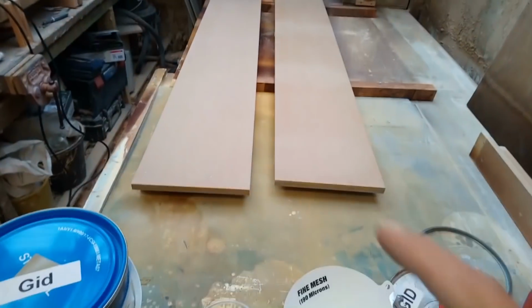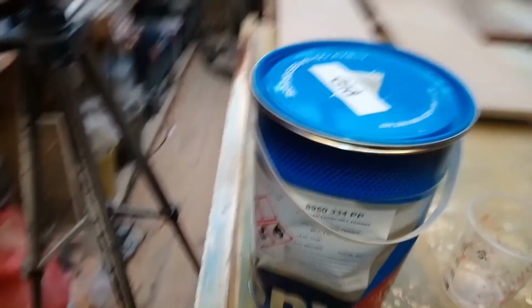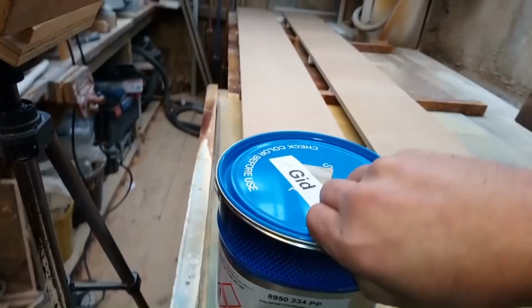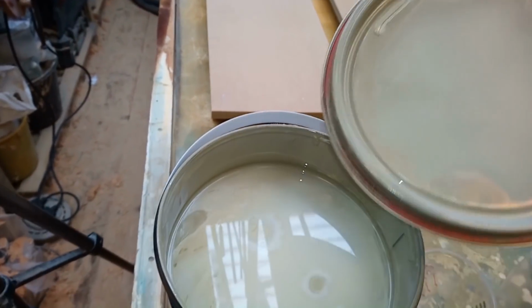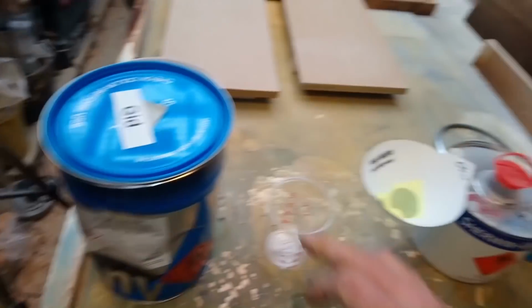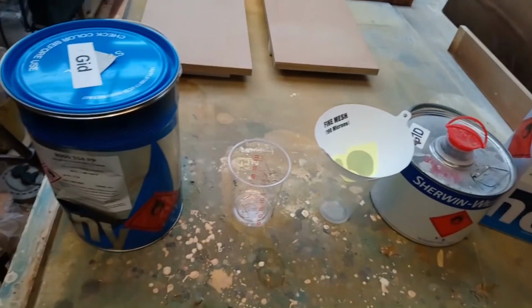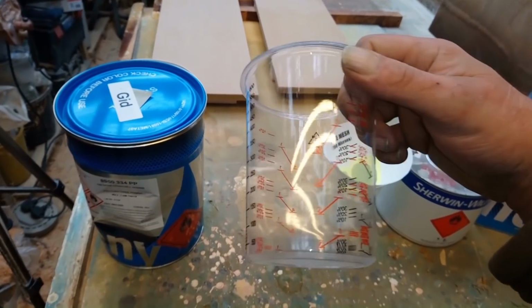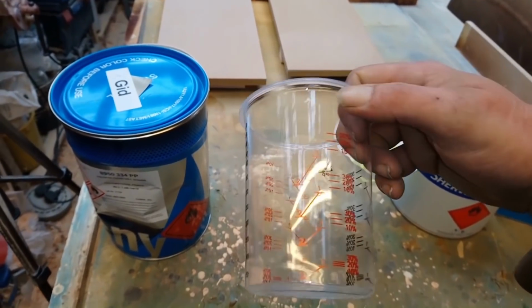And here I've got the end panels. This is the paint. PU paint. Polyurethane enamel. And it's sort of that colour. Needs a shake. So two of those. One catalyst, bit of thinners just to dilute it, mixing cups, have 2-to-1 there, look, you can see it,